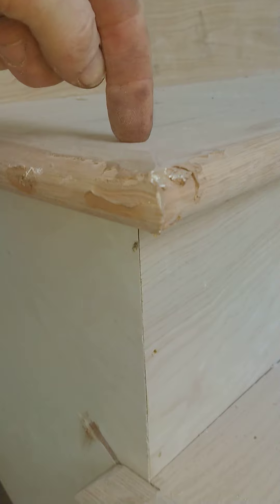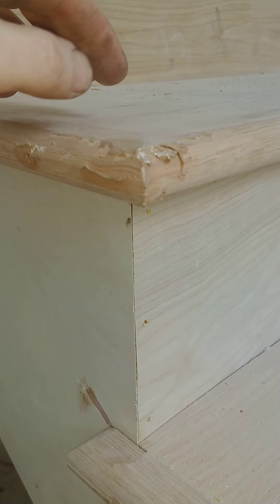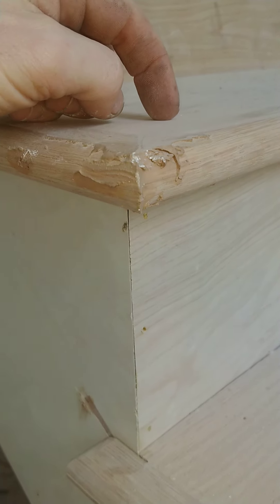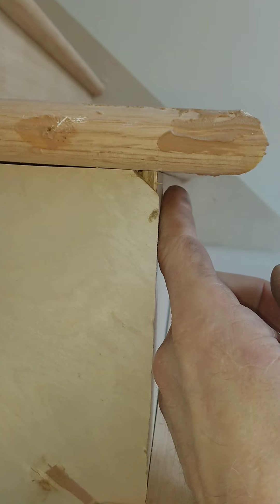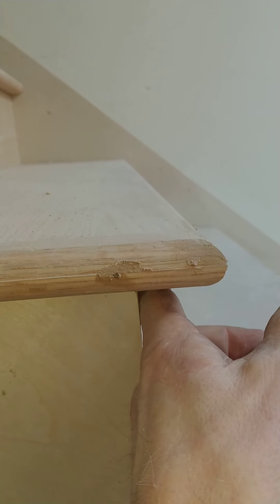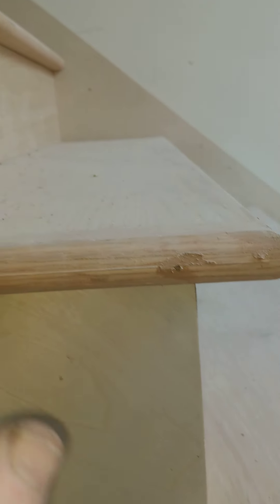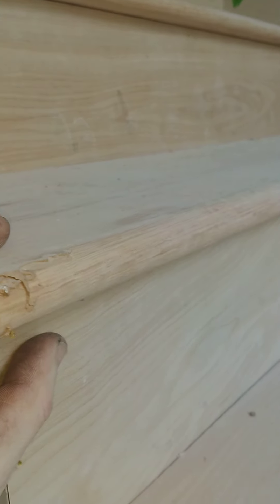So that's right where your spindle is supposed to go, but things have changed a little bit. People are starting to put them in board a little bit. I always like the idea of putting the edge of the spindle even with the edge of the riser - that's where it's supposed to go. I try to go by that rule.